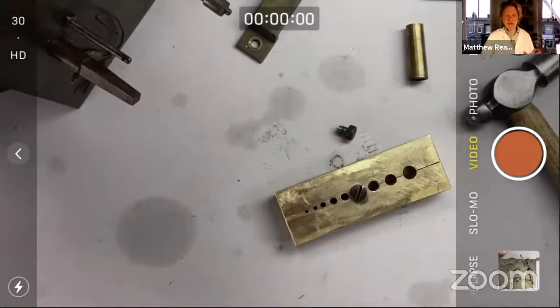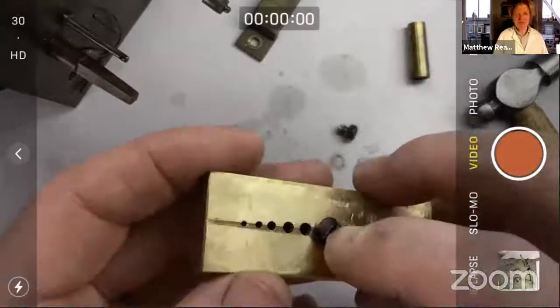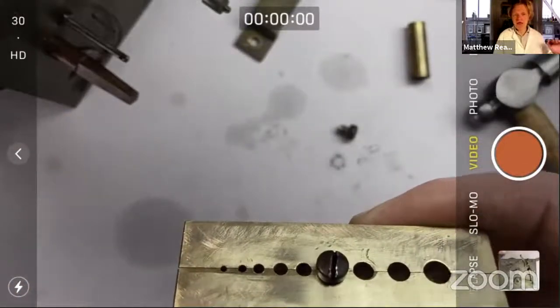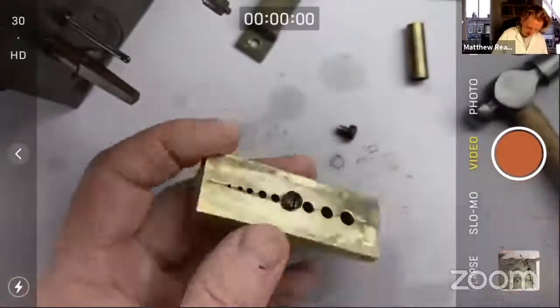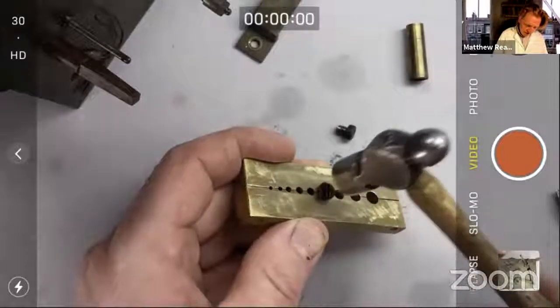It's always tricky when one begins to conjecture what somebody might do in the future. We don't know, I don't know, and to a degree, I don't care. That's out of my control. But what I would say, contradicting myself, is that by doing this, maybe I will prevent somebody from seeing those burrs, putting it in the lathe, getting a file and refinishing the whole screw, like a gramophone record. So that's all I'm going to do, is just tap them down like that, exactly like we did on the barrel arbor, and leave it.